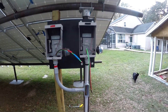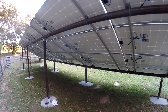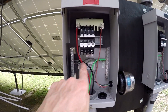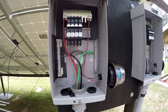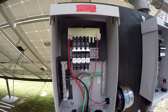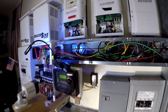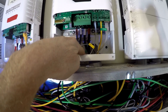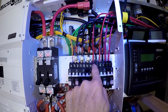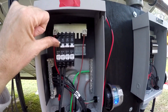Since it's going to be dark soon, I'll go ahead and wire in all this stuff while there's no power. We've got both of the combiner boxes wired up — DC positive, DC negative, and ground. The surge protector and the breakers are all set to go. I'm going to leave the covers off for now. I've got voltage on all of my circuits, so I'm going to go ahead and switch those on.